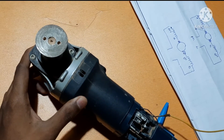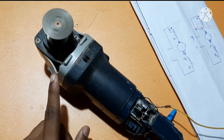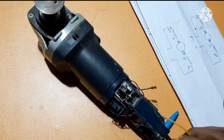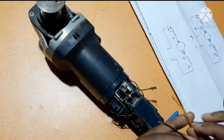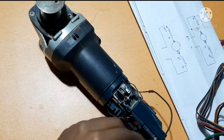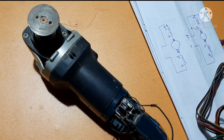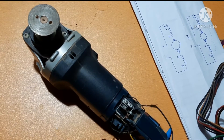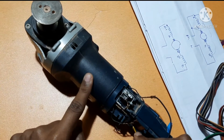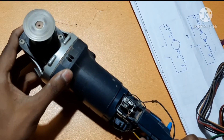It's clockwise! Keep looking at the rotor — yes, it's clockwise direction. Now I am giving positive here and negative here. The direction was not changed when reversing supply polarity, because to change direction you have to interchange the field windings. Giving negative here and positive here — yes, it's also in the same direction, clockwise.